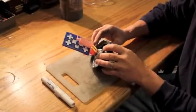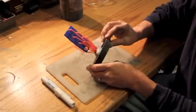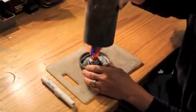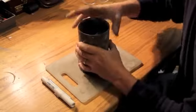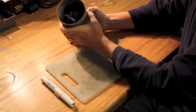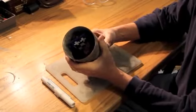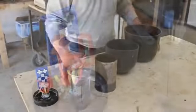I'll also attach a few other little belt parts to this sprue base before we cast it. When you put the flask around it, make sure that none of the wax is too close to the sides of the flask — you want at least a quarter inch clearance everywhere. Now you see the final belt parts attached to the sprue base.